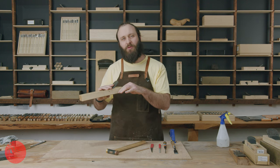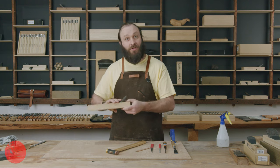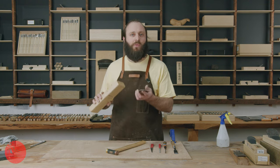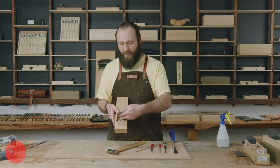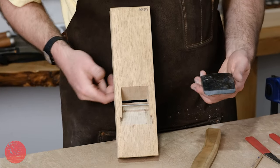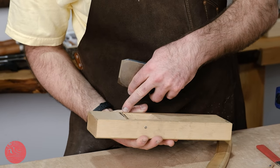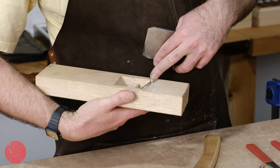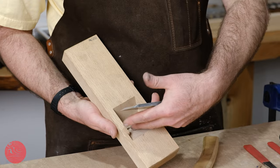You can hear as you drive home the blade and pull it back out — the pitch changes, and that's something that you start to become used to and can listen for. So now we read what this information is telling us. Here on the back, on the base of the plane block, we have not much contact at all. We do have very heavy contact here on the sides of the blade channels — this is not what I would expect to see. I would normally expect to see contact on the back.